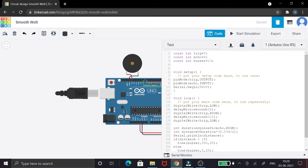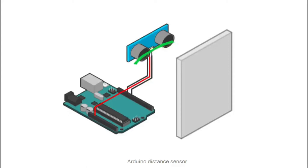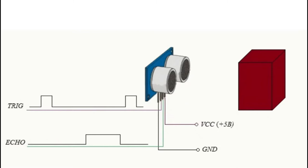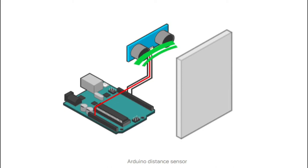The ultrasonic sensor measures distance to an object using ultrasonic sound waves. Inside, it uses a transducer to send and receive pulses. The trigger pin helps send the pulse and the echo pin helps receive it back from the obstacle. If you want to know more about the actual working of the ultrasonic sensor, I'll put a link in the description and in the top right corner.